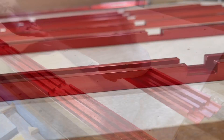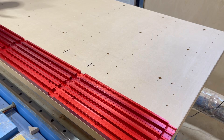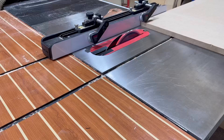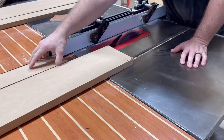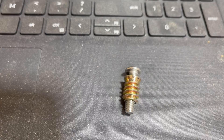I'm trying to wrap my brain around how many t-tracks I'm gonna use. The last one had seven; I think I'm gonna use six for this one — I really didn't need that many. The easiest way to find the measurement of the strips: put all the t-tracks down in one section, measure up to the very first edge of the last t-track — that's your measurement — then divide by how many strips you want. I believe I got around three and a half or three point six five. I made a bit of a mistake here but I'll show you that later. I've drawn up a little diagram in VCarve.